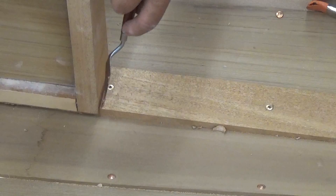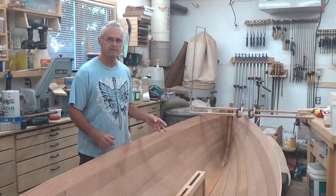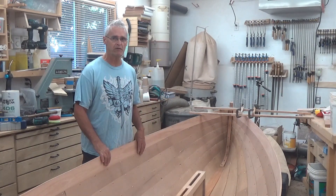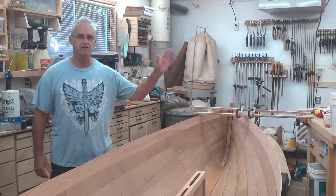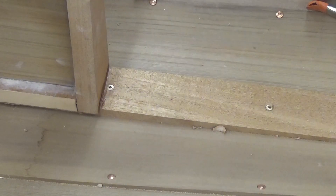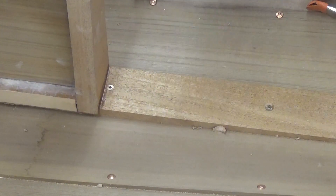I'll get in there and clean up the squeezed-out epoxy. I can see a bit of a gap underneath, so I want to get some thickened epoxy in there — can't have water sitting under there — so it's kind of a very small fillet. Now that the daggerboard box is in, the next step in the video series will be to steam-bend some frames in here out of white oak. Thank you very much, see you next time, and as always thank you for watching — do consider giving it a like, maybe a share, and if you're not already a subscriber, hit that subscribe button.